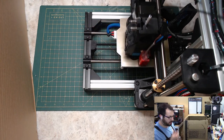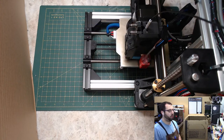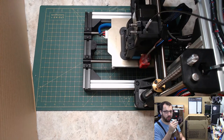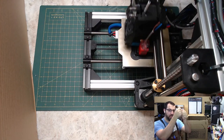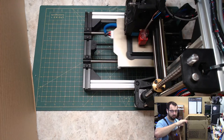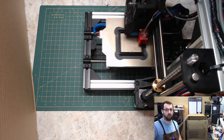So here's the thing with the pressure advance tuning. You actually don't have to finish the print. You just need to get to the point of the print where you can see that it's good. It'll be easier to see, and I have a video on my channel going over this in detail. But basically, you're looking at the corners, and the corners will go from having way too much bulge to really good, to being really wispy, like there's not enough plastic there. And that's your pressure advance settings. So eventually you got crappy corners, not as bad, good. So you just have to get to that good part, and then once it's good, you measure it and you're done.